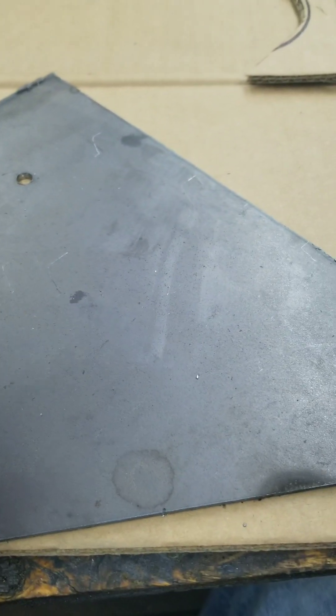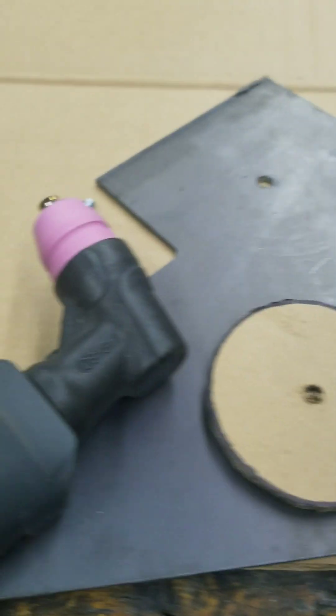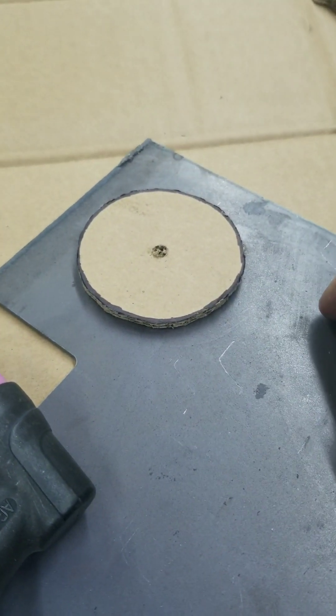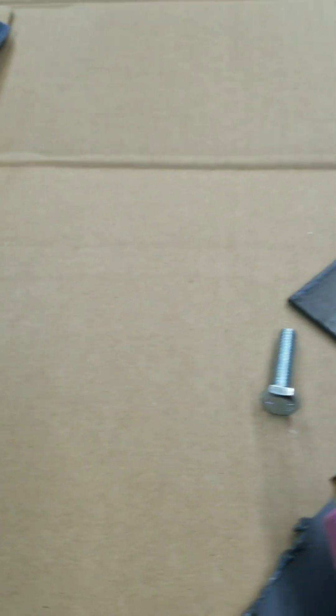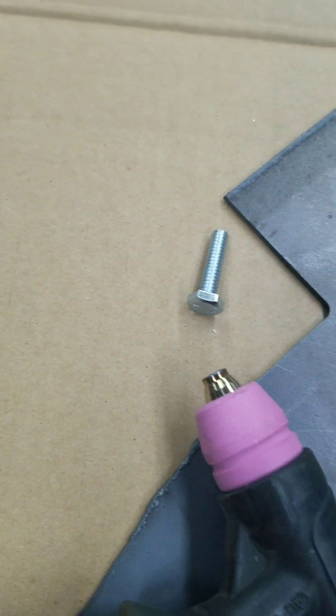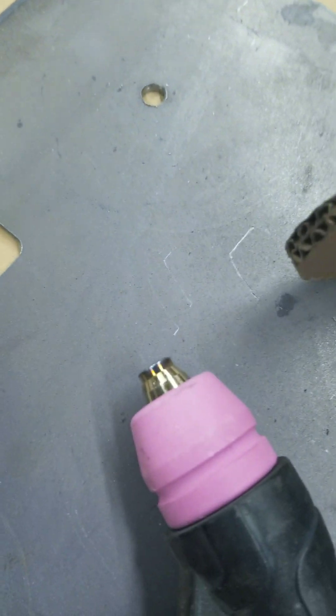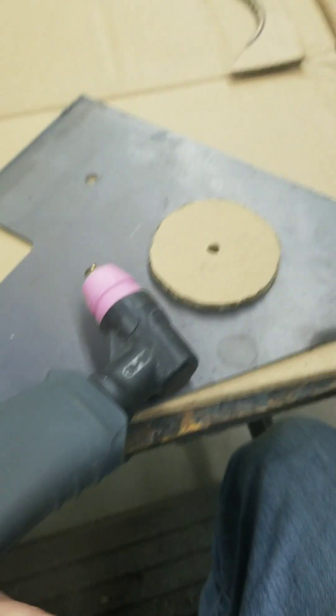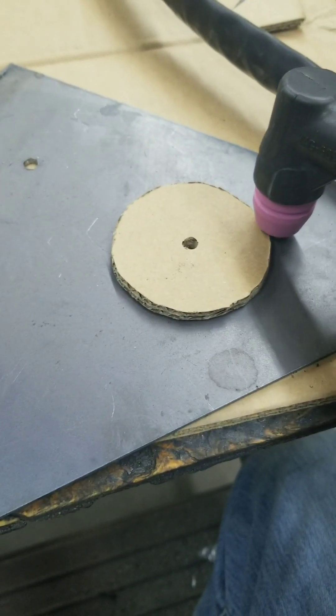What I've found works quite well is thin paneling plywood — very thin — or cardboard. I'm going to mount the cardboard on the steel and drag the torch tip around that circle to make the cut. Some torches come with a standoff, but I've taken it off because it makes it difficult to follow any line or template. The cardboard is about the same thickness as the tip, so when I start cutting I slide the torch up against the cardboard and the tip is in the right spot. I do a measurement first — how far the center of the tip is from the edge — so I know how much bigger I have to make the template, then I fasten down my plywood or cardboard.